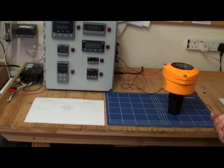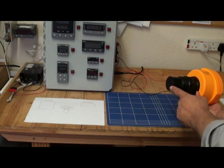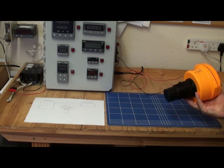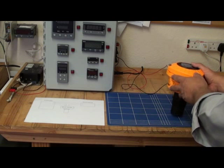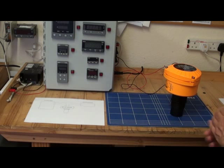The measurement range is programmable from 0.3 to 8 metres. Ultrasonic pulses are transmitted from the transmitter face and reflected back from the surface of the liquid level to the same transmitter. By measuring the time delay between the transmit and the receive signals, the microprocessor controlled electronics is able to calculate the distance to the liquid level.